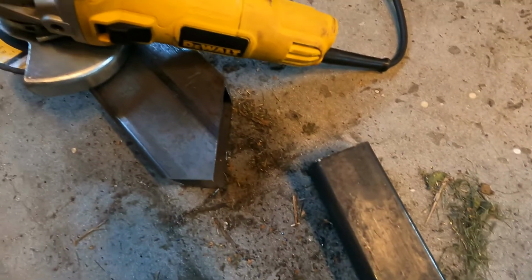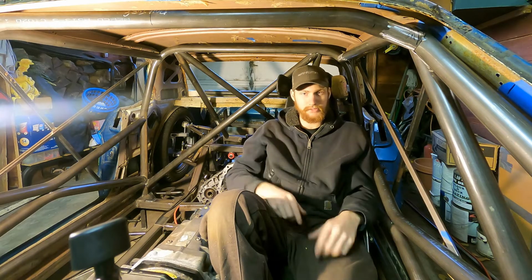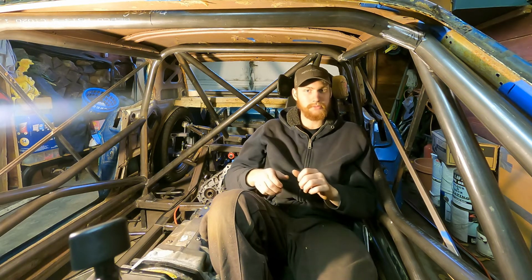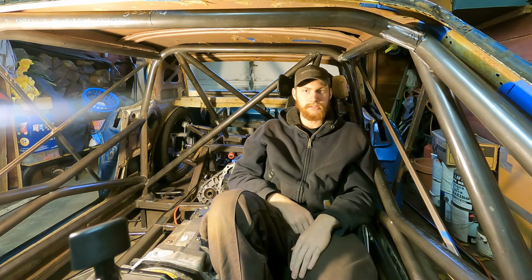4.5-inch angle grinder, it just has a flap disc that lived on it the whole time, and I just used it for polishing things up, cleaning them up, getting rid of burrs. If I had to just adjust a cope just a little bit, I was able to do it with the sander disc instead of having to cut more material off, which worked really well.